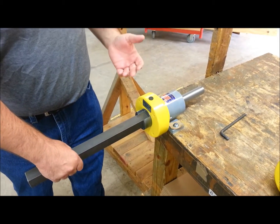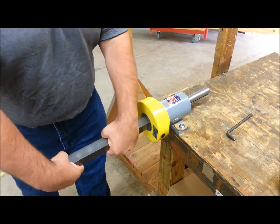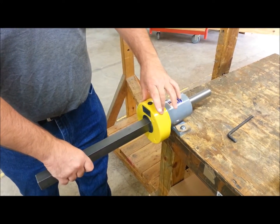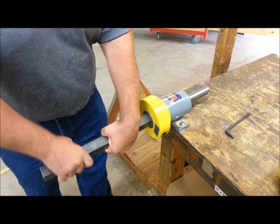However, it's called a safety chuck because if the operator forgets to close this unit when it starts to rotate, it closes automatically. There's a cam inside of this unit that automatically closes this plate so the shaft is always captured.